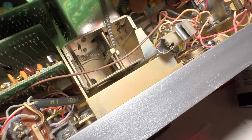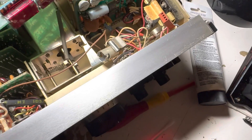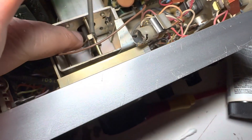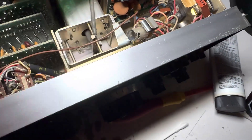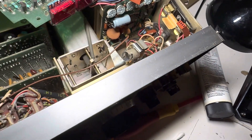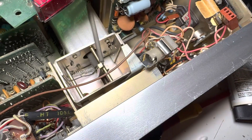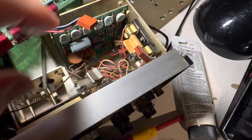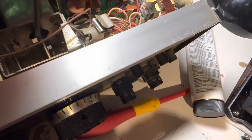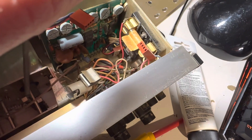Just lubricate the steel parts. All these Drakes have a little metal wire on them because this little fork can wiggle around and change the inductance — that wire was a fix for tuning stability. W2AEH sells a bunch of replacement pots or a VR regulation board for this radio, since all those pots go flaky.